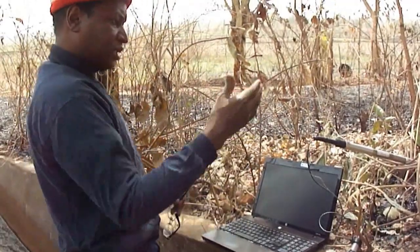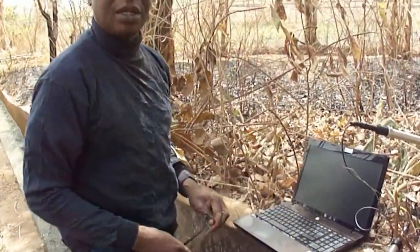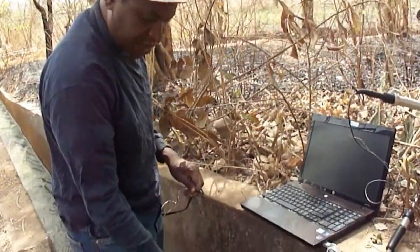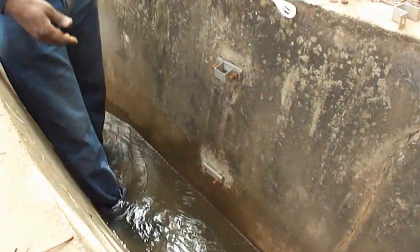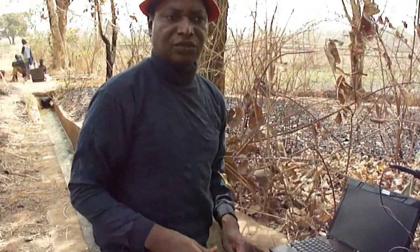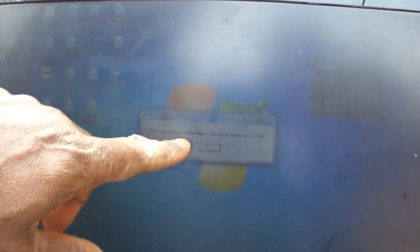What I will do is check what is inside the diver now, then clear everything and put my measurement time. I will look inside the diver using the LDM Logger Data Management program. For this irrigation canal, water levels are generally less than 40 centimeters, and I can make measurements every six hours — so four measurements per day during the growing season of this rice irrigation scheme. I connected the diver to the computer first before starting LDM. At the beginning, the program said the port not present in hardware has been replaced by COM1. COM1 is a good number, so I can continue.